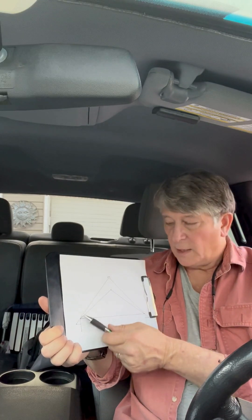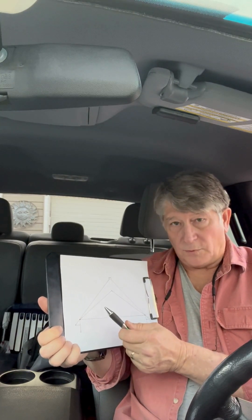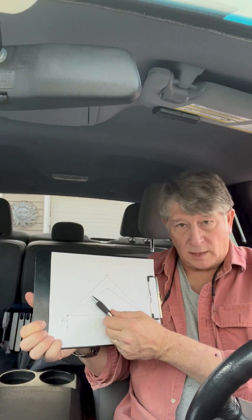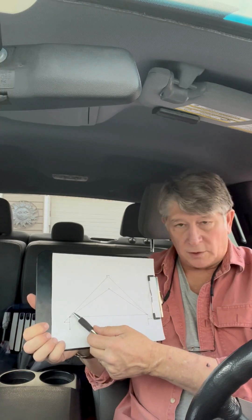And let me tell you, if this chokes off, if the baffles don't come up far enough and do not allow intake of air from the soffit, you get mold growth here and you have to take the roof off. There is no human who can be skinny enough to get down into this area — it just wedges down to nothing.